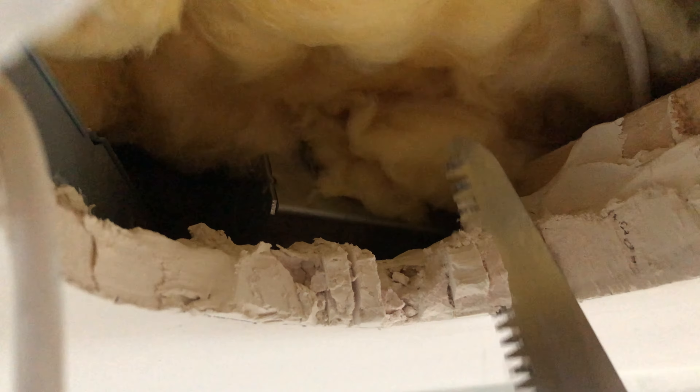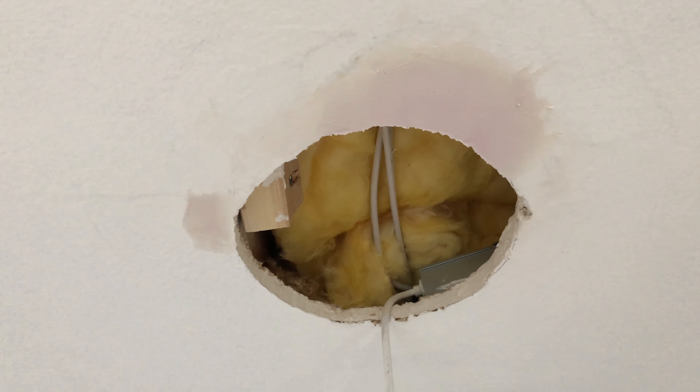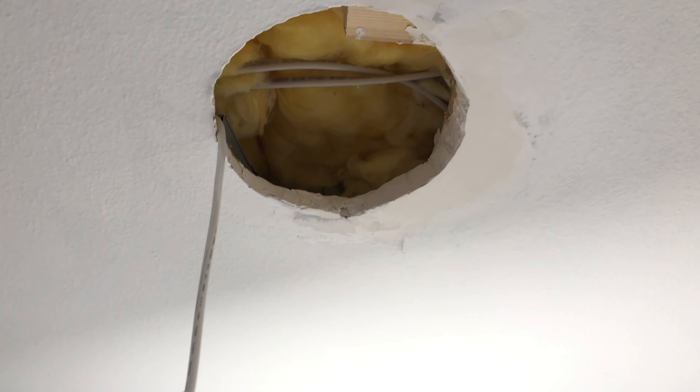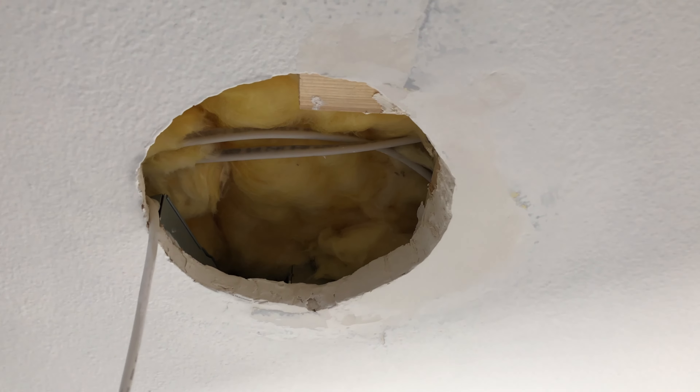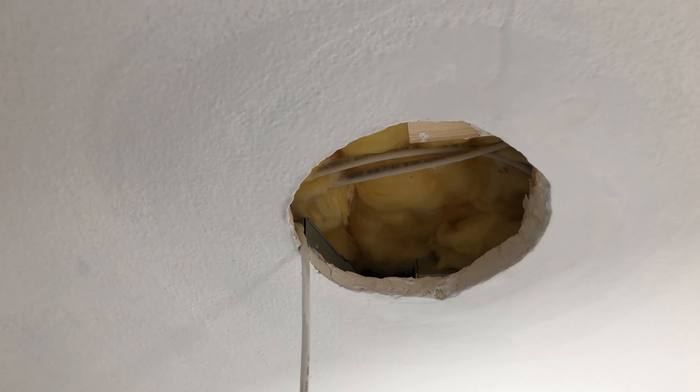I've just been gradually, very slowly, kind of cutting it off. I got some of this quick-dry spackling compound on there — we'll smooth that off in the morning and put primer on it. There's my nemesis; I got a little bit more spackle on there. I think this is the best I can get this, so I'm going to paint some primer on there. The spackle has dried; I just sanded it again. I put some primer on there and it has dried.